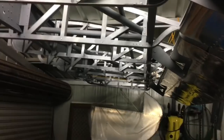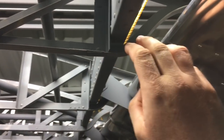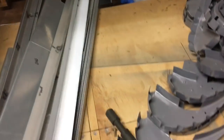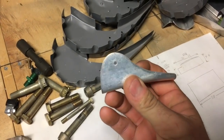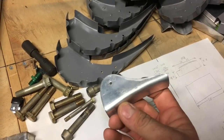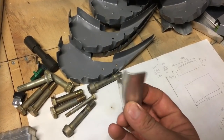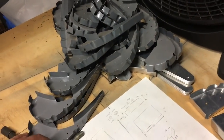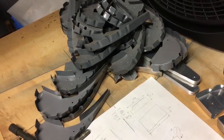What else? A long time ago when I was building some of the ribs, like the ribs here, that's O condition, which was heat treated, and same with certain other brackets. So like these ones here, when I hand formed these, they're actually O condition. I heat treated them to T4 condition. That was a long time ago. Since then, it's all hand built. All of these pieces I've made wooden dies and then formed them over that.